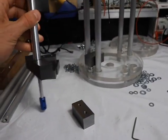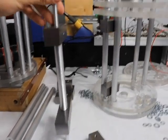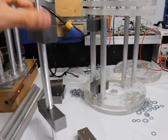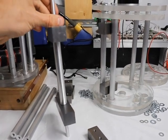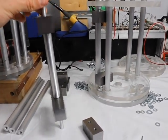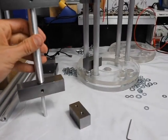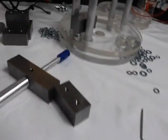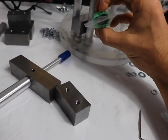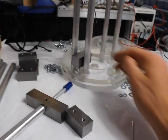And most importantly, this is the new shaft that we also made out of the 5/8-diameter aluminum rod. You can see we have our 1-inch square stock iron — steel, but it's pretty much pure iron, mild steel — on there. We have an Allen screw on either side. This is perfectly balanced; I kept it thick in the middle so it won't warp. Then we went down to 8mm diameter on either end. The bearings are skateboard wheel bearings, same as the other machine — 8mm on the inside and 22mm on the outside. The hole I have is one inch, so we're going to have to build that up a bit.